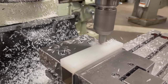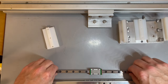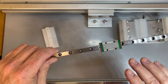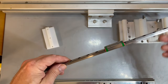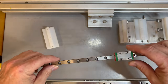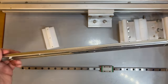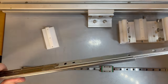What is a linear bearing? This here is a real linear bearing - it is a ball bearing that slides back and forth with zero play, absolutely nothing, extremely high accuracy. This would not work well in a van because the van flexes, and to get it set up you'd have to have it basically perfect across from each other, which you're not going to get in a van build. Some people say, why don't you just use drawer slides? Drawer slides are not accurate and they're also very very weak, so you don't want to use drawer slides for this.